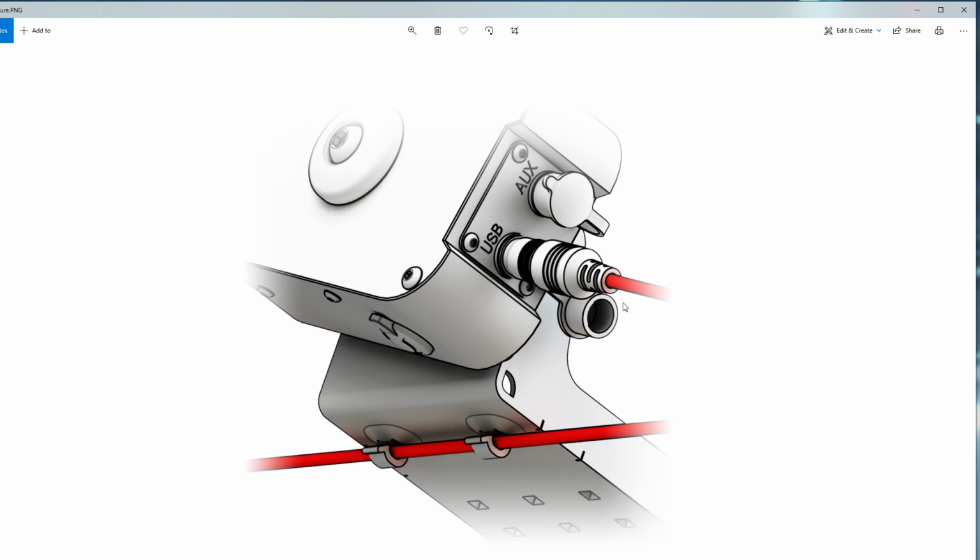And what happened was my cable broke. After 2 months, basically 2 days ago, my cable broke. I had to take the cable, cut off this plastic sheathing very carefully, take the thing apart, solder the wire, put it all back together again, and there we go, I'm good to go. So how do we look at the problem? And the problem is, this moves.